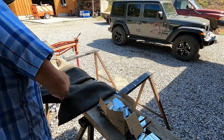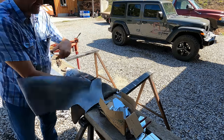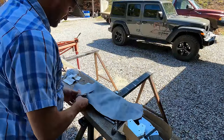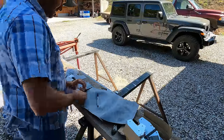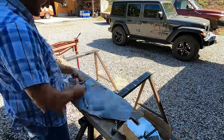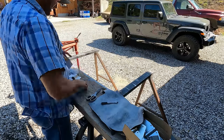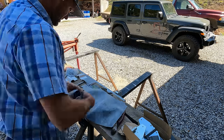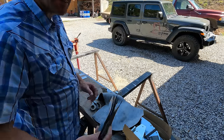I'm still going to use the urethane caulking to seal everything, and I'm still going to drill holes right down through my roof to ensure that the lower bracket goes nowhere. This has nothing to do with money. The main reason for doing this is because the sun does not hit those panels until almost 11:30 in the morning, and it's gone by about 3:30 in the afternoon, because currently where the ground mount systems sit, they sit very low.